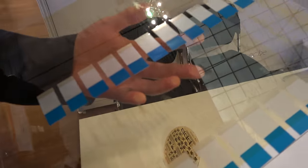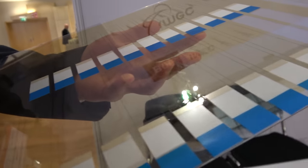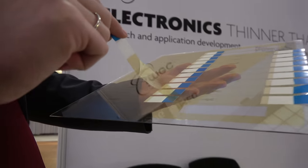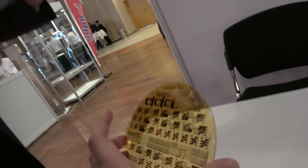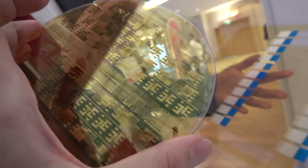This is an illustration of how the plastic technology is processed in reality in the foundry. It's laminated onto a rigid glass carrier for all the technology steps. When devices are made, we just delaminate it — peel it off and put it, for example, in paper, in plastic, in smart packaging. We have different scales: this smallest scale is a lab process for trying new things fast. This bigger scale is for prototyping — making 100 or 1,000 top devices. In a real foundry it goes up to several meters by several meters.